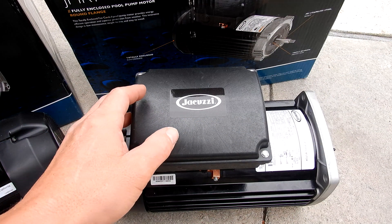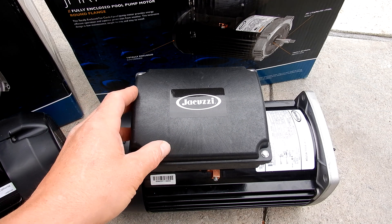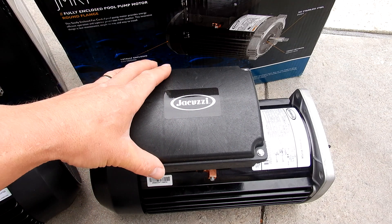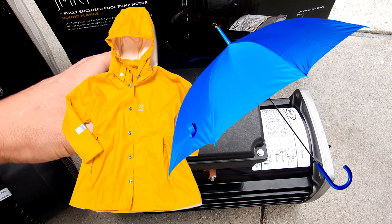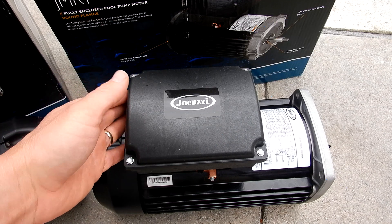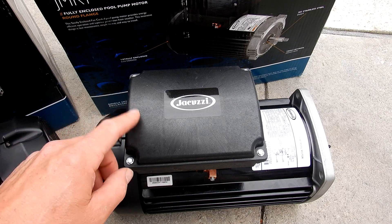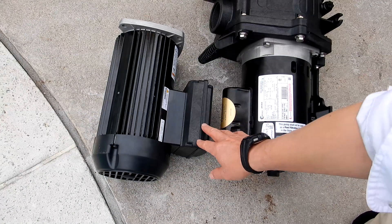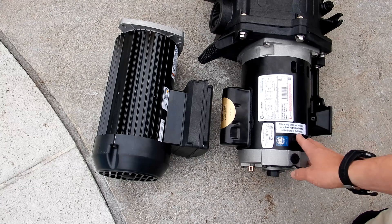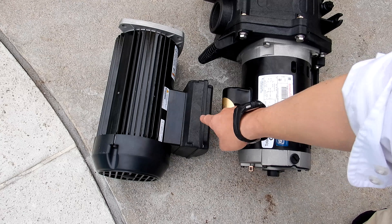The fact that this motor is totally enclosed will prevent intrusion by outside air, breeze, and moisture, which is the number one cause of motor failure when the windings fail. What makes your TEFC motor different than your standard motor is that it's completely water sealed — think of this as a raincoat versus an umbrella. Your standard motor will let water and moisture in; this one will prevent that, making it last a lot longer. You can see all the vents on the standard ODP motor that let water and moisture in, eventually causing it to burn out, while a TEFC motor is completely sealed.